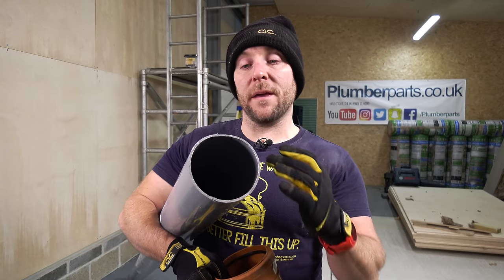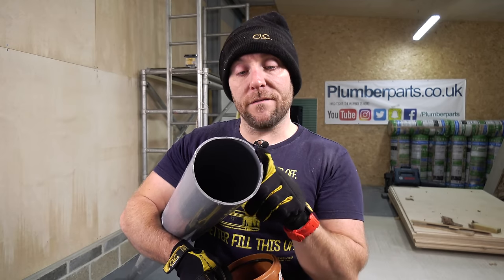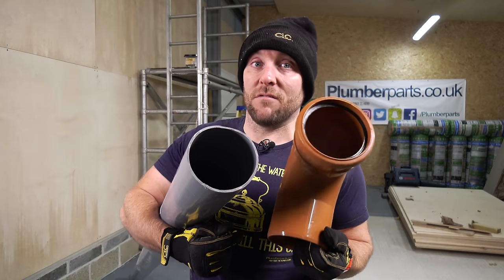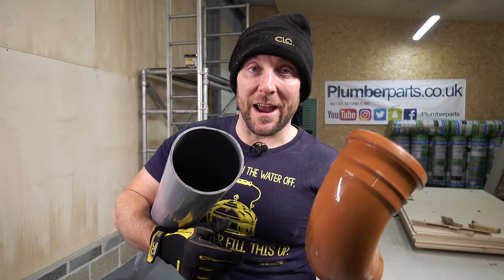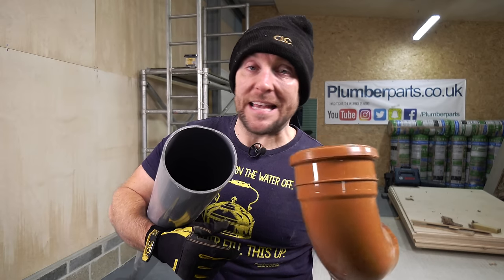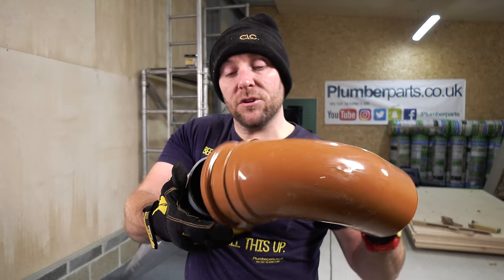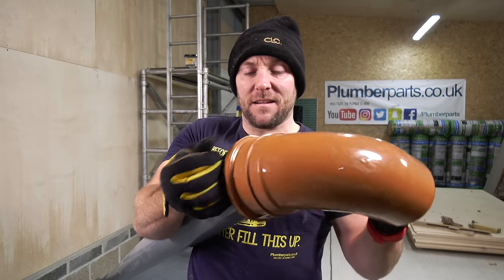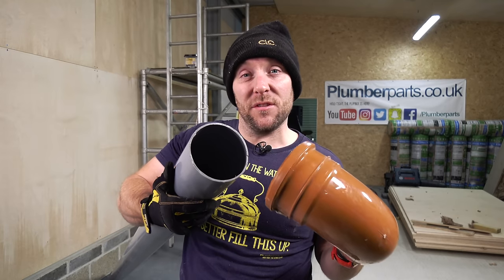If we look closely at this pipe here, I've just cut this with a standard oscillating multi-tool - I've got a Bosch one. We've got a very hard right-angled edge on the end of the pipe. When you're trying to push that into a fitting - I know we're going from brown underground to grey above ground here, but it's effectively the same problem. Inside the fitting there's a small rubber flange, and when you try to push these two together it's really, really difficult to do. That's problem number one.